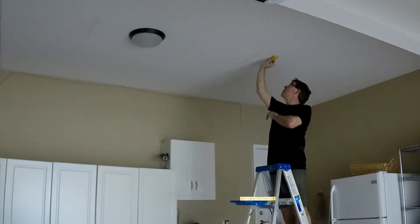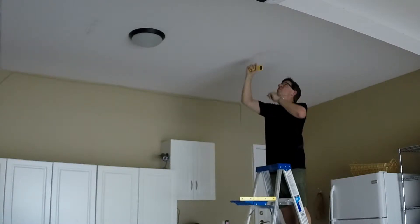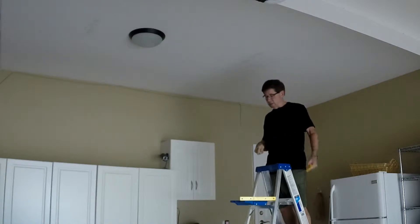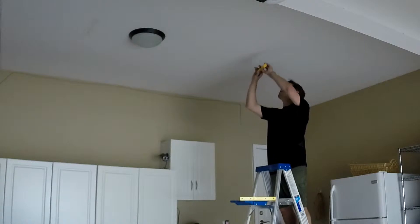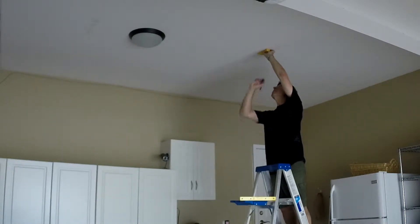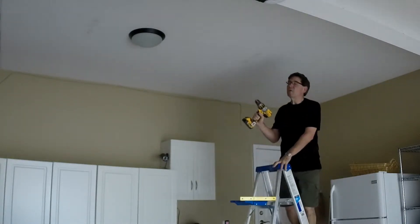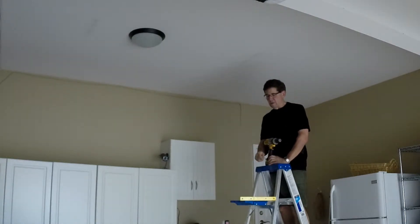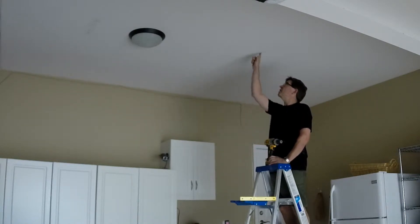In this case, I've determined that the joists are running in this direction, and this is the joist I want to hang my first ceiling post onto. So step one: find that first hole location. It's very important that I get that right on the center of the joist. I'll make my mark, and this is where I'm going to have to do an additional trick, because it is so important to get all of the lag screws for that ceiling post into the center of my joists.